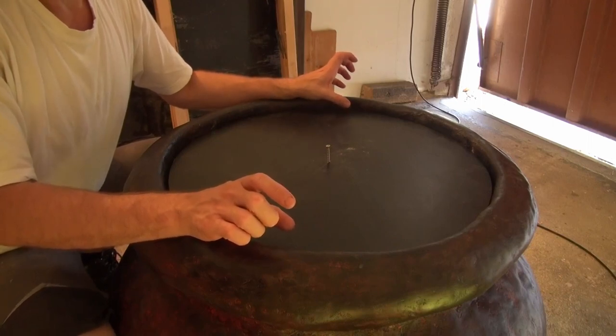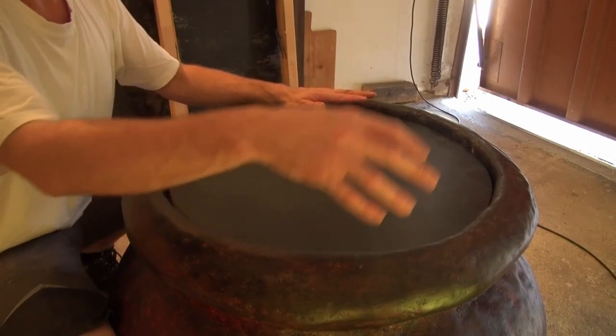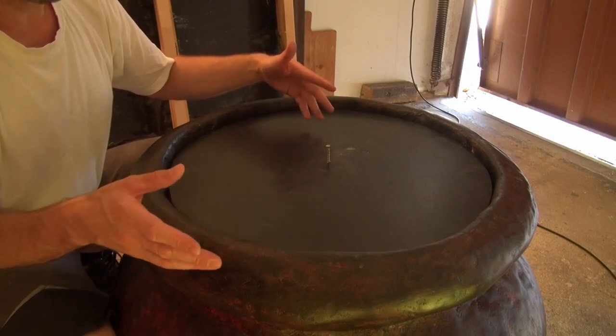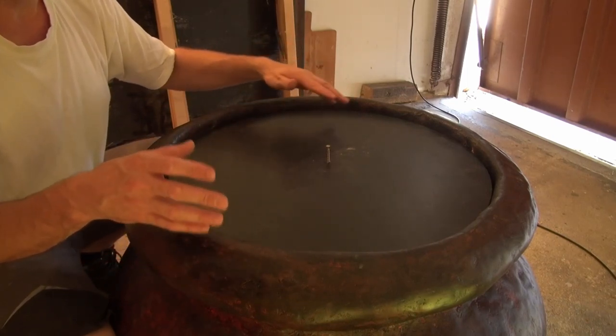The height of the expanding foam will be about 5 to 8 cm, so I will add some blocks of styrofoam as a template for the height. But you know, we don't talk about 5 mm here, so 5 to 8 cm are more an orientation here.